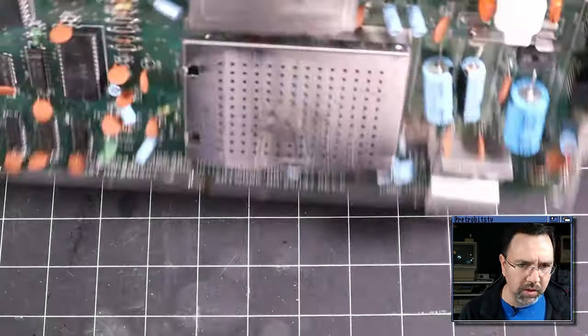Okay, same thing. So we don't seem to have any chip select going on, which is what we expect to see when we've got the dead test cartridge in and we're booting into Ultimax mode. So that's a good sign. We don't have the same failure coming out of the PLA as we did on the last machine. So that's nice. Now, I was curious why I wasn't seeing a full 5 volts when I was looking at the 2 volts per division on the scope.